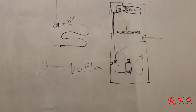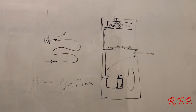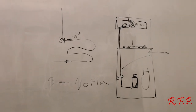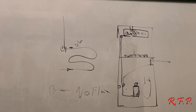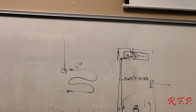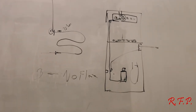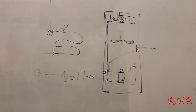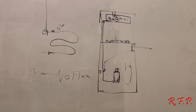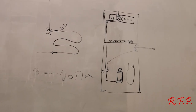Oh, I do know too, the burners are rusty. I've had the end of the burners be rusty and it won't pass the current. The flame has to be on the burner and the burner has to be clean. So you gotta have clean burners, good ground, clean rod, and check your current on it. So ground, burner, and rod.